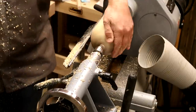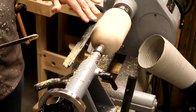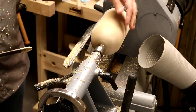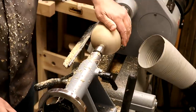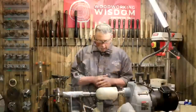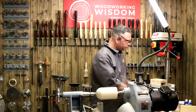That'll do. Because in a moment, we're going to actually put a different center in here, a single-pointed center, so we can turn right up to that hole, or what will be a hole in a second. But we're starting to get somewhere now. We're starting to look sort of remotely like the top of our R2-D2. There's still a little bit down the bottom to do.